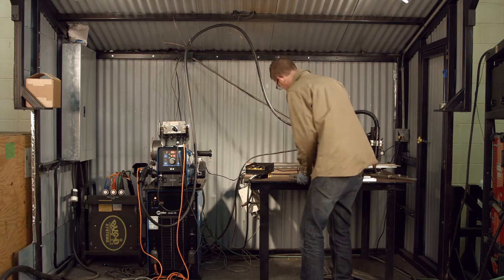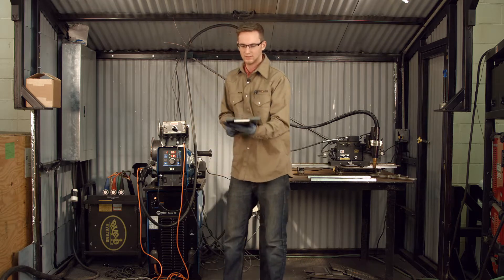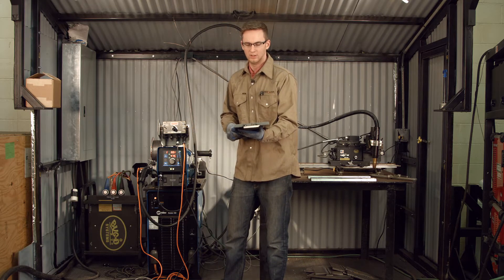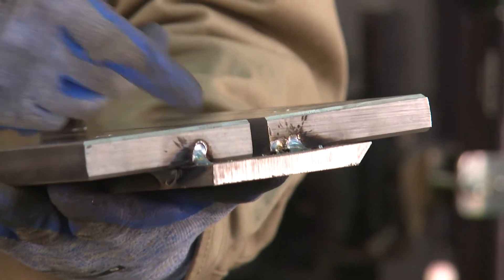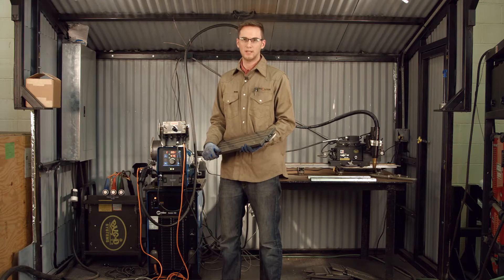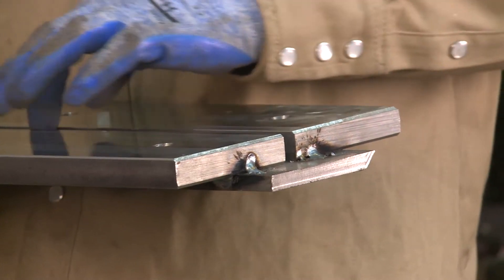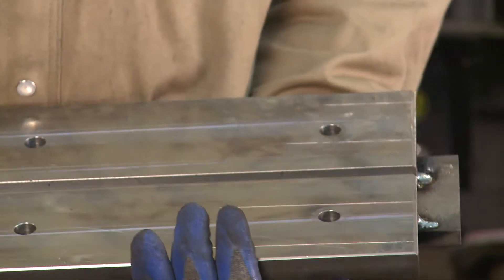It's a demo setup. This is a three-quarter inch plate. As you can see, there's no bevel, and this is a three-eighths opening. You can see these are machined — it doesn't need to be machined, it can just be the off-the-mill plate. With the grinder, just make sure it's clean inside the groove and take off the mill scale.